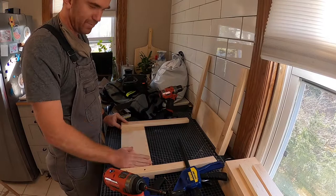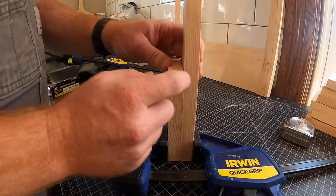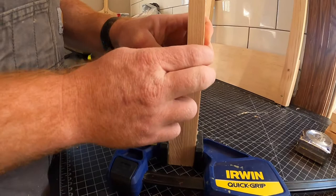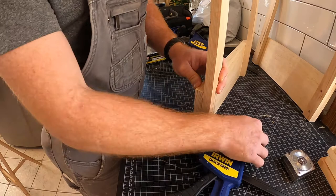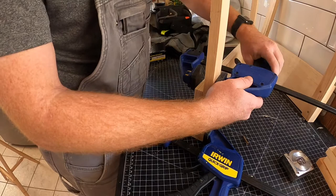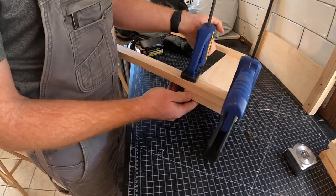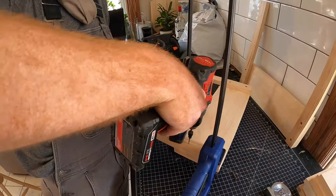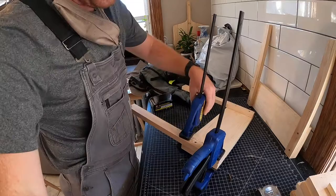For the next leg, we're going to do the exact same thing, so we end up with that sub-assembly. We'll ultimately have two identical sub-assemblies that when the chairs are finished will be a mirror of each other, but for right now they're the exact same thing. This apron is a little cupped — it's cupping away from the board. So I'm going to clamp up here to try and close that up. Screws can sometimes not pull a gap closed, so I'm going to clamp that shut before I drill the hole.